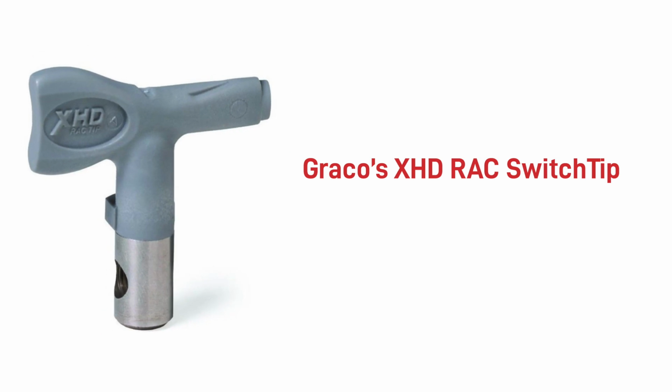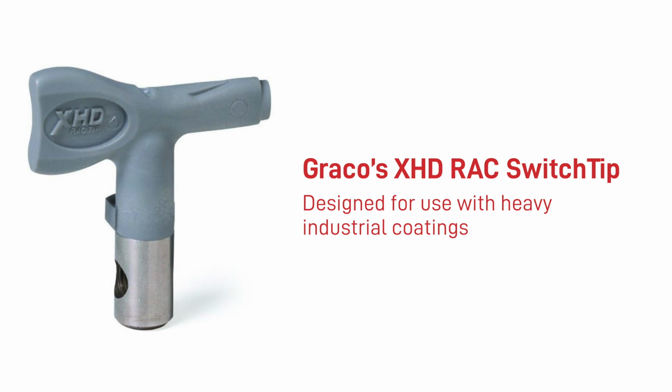Graco's XHD RAC switch tip is designed for use with heavy industrial coatings that require higher pressure to atomize. They're recognised by their oversized grey handle that allows for easy rotation, even with very sticky coatings like coal tar and mastics.